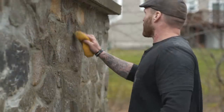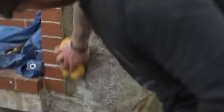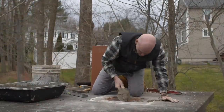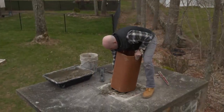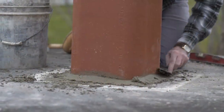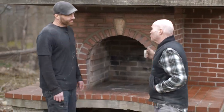Benjamin will go over the wet mortar in the fieldstone joints with a damp sponge in order to match the previous finish. To cap off the day, I'm installing a new 12-inch by 12-inch clay flue by countersinking it into its original flue's position, securing it with type N mortar. This will prevent water from infiltrating the oven. All set — flue's in, we're cleaned up. What do you think? I think it looks great. The repairs are awesome.